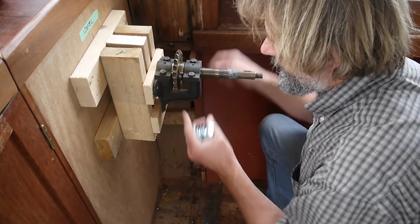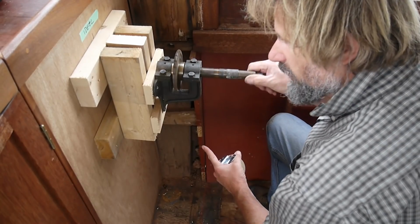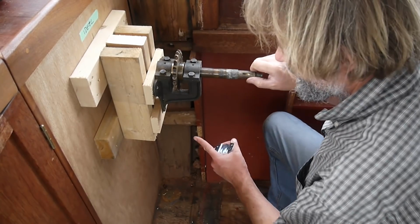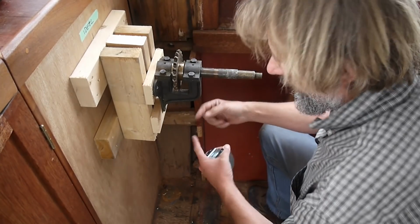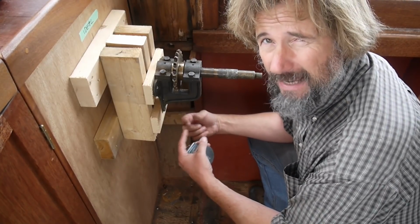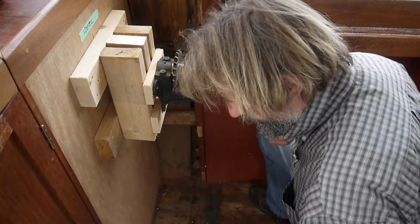Okay, so basically, right off, there's chain that goes over here. Only 2 or 3 feet of chain because it's only got to be able to deal with 2 turns. And remember, that sprocket that's going on here will be significantly smaller. So the chain will loop over, and then it'll almost immediately switch through some shackles to the stainless steel wire rope, which will then have to be directed aft